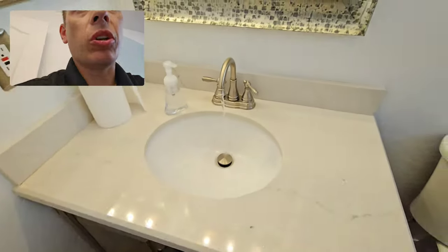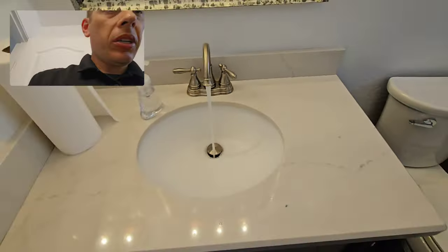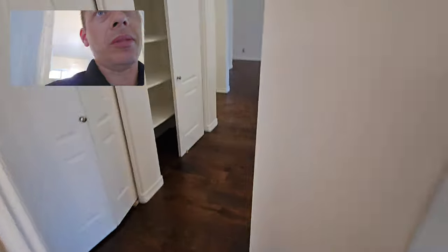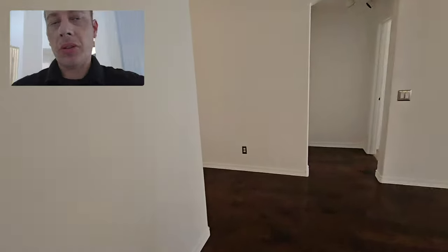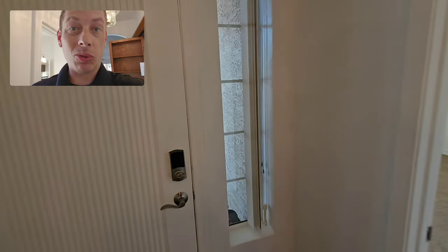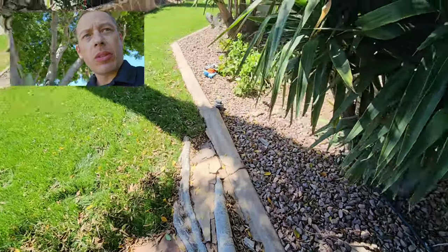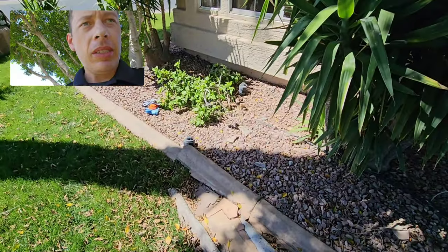So I'm just gonna let this run a little bit and I'm gonna see if I can't find this sink through the drain system located out front. Shouldn't be too bad. It's ABS cleanouts, 1997 built the house, but we've got some decent root damage in the front. So I'm gonna grab my drain camera and I'm gonna throw it on those cleanouts. See what we can find.